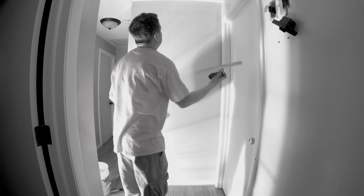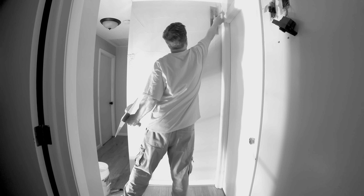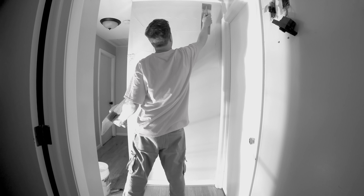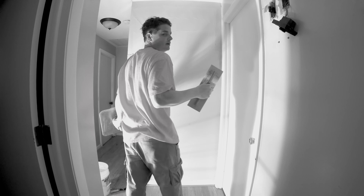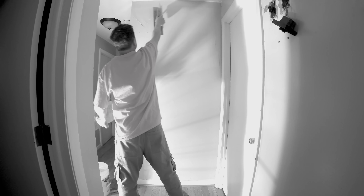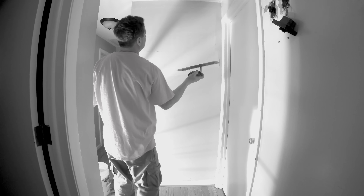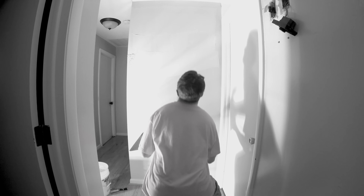Clean that up and do a swipe across the top. To leave a little bit of mud, you don't want to rotate your wrist too much — keep it on an incline of probably about 25 degrees. That's what comes off there, not taking much away but leaving probably about an eighth of an inch. And as you can see, it's perfectly smooth.